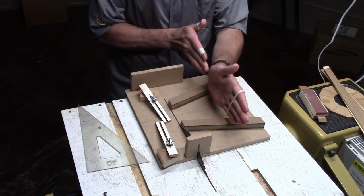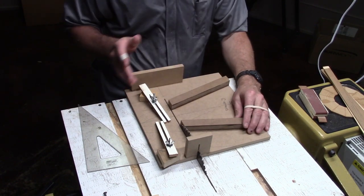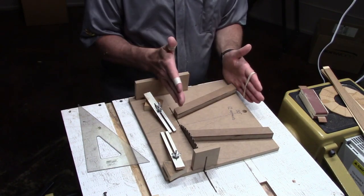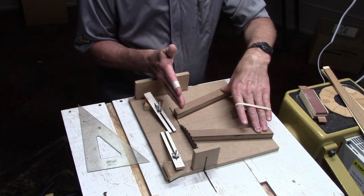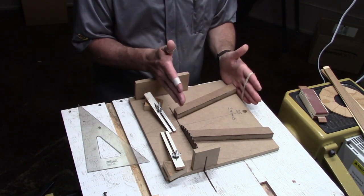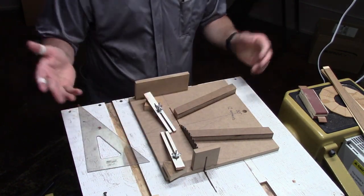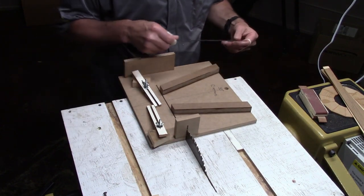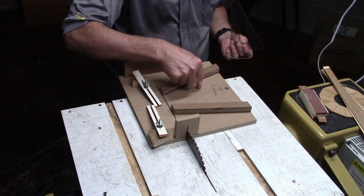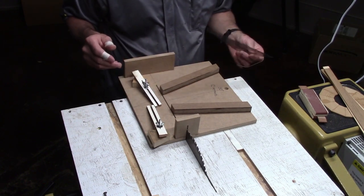Some people get that really tight, and it runs true. I've never bought a table saw where I could do that. It always hangs up, okay? This half of the sled is the basic idea. And everything that I've turned up until pretty recently is built on a jig pretty much like this. It's this part of the sled. Get rid of that, get rid of all this, and that's what I used. And you build it by putting your runner in, gluing it, and then probably best to screw it from underneath so that the runner and the base ride true.